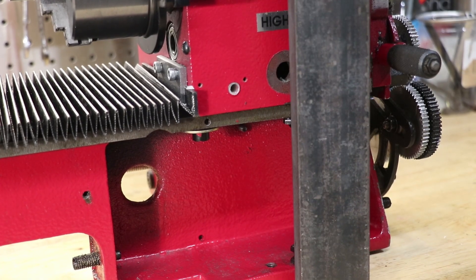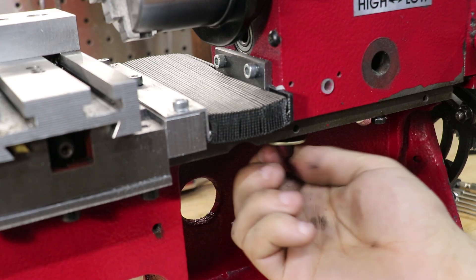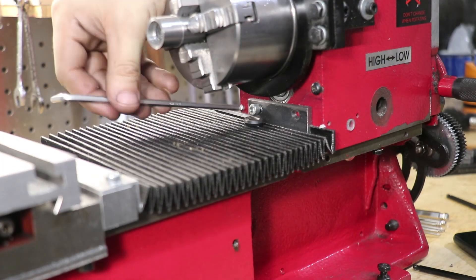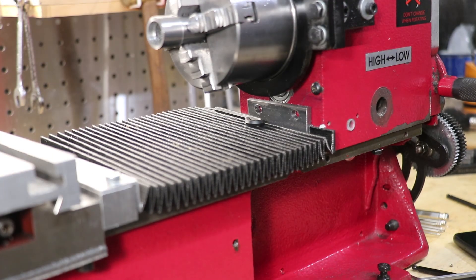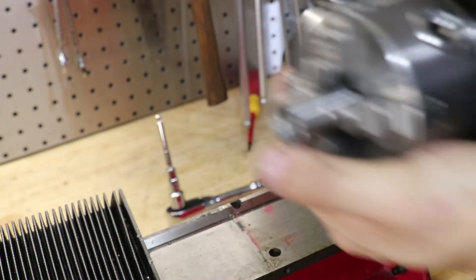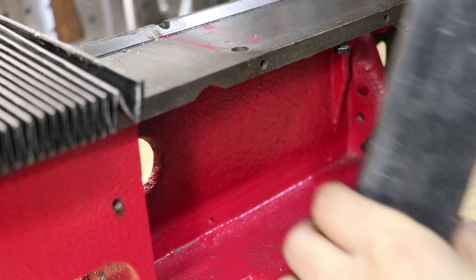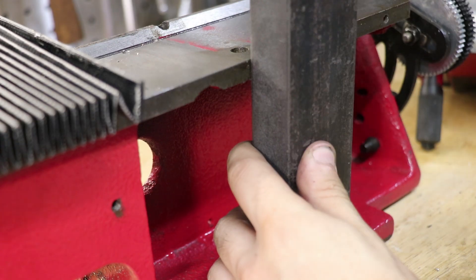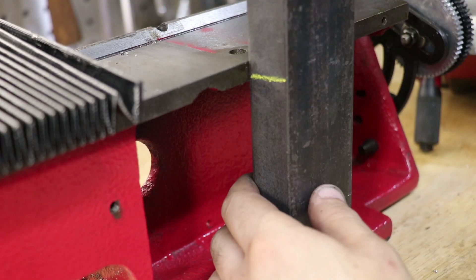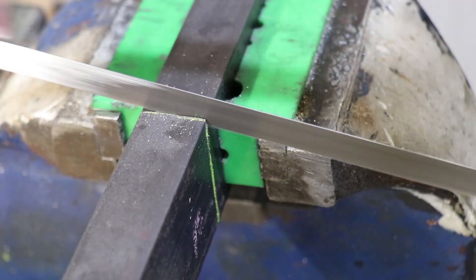I know the space is needed to house the motor, but the fact that this is all that's holding it there to give it rigidity is a bit disappointing. I'm going to be using a piece of 25 by 50 steel to hold everything in place. The cutting action of the lathe will want to pull the whole floor up, so I want something that will be very good in tension. I might be tempted to fill the void later with some epoxy granite to help dull the vibrations, but I want to wait and see how it turns out first.